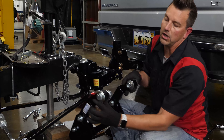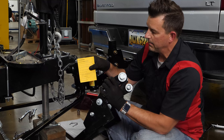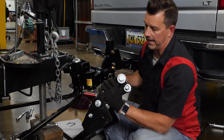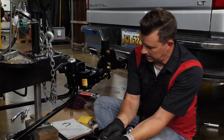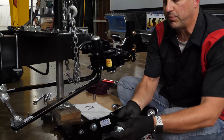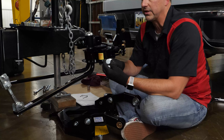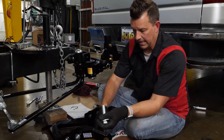Your yoke has the hardware pre-installed. We give you the card that breaks down everything, but it's all pre-installed. It does say loosely installed by the factory on there, so we'll go over it real quick just so you know what you're supposed to have. This is really the only bolt that's kind of an odd size — it's an inch and an eighth — because it's a 3/4 inch bolt and nut that go on there.